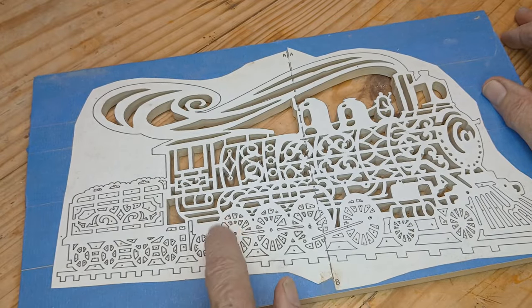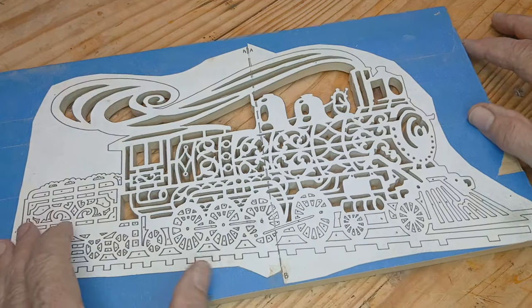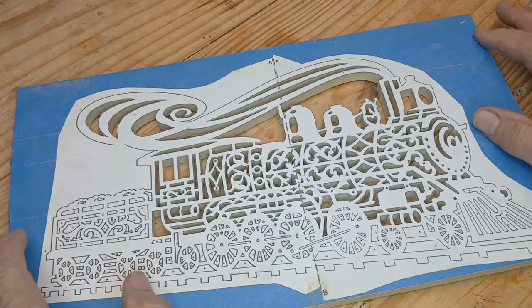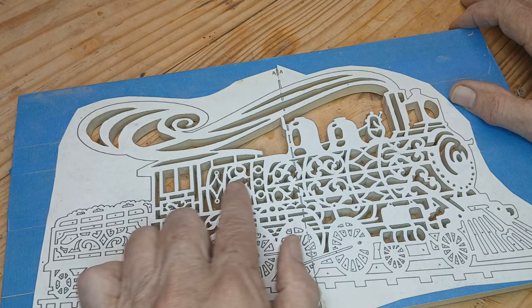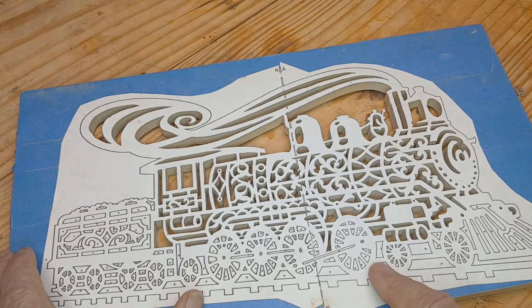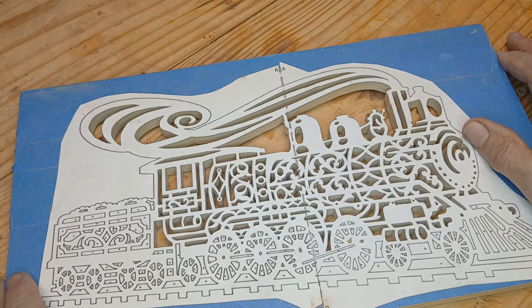In these areas I would probably use a 3 — I cut all those with 3. Some of the really tiny ones here I might prefer to go to a 1. Now pieces like this, these cuts I could do with a 5. That's my choice, but not necessarily the right choice. Somebody else might say different — it's a matter of personal experience and what their particular scroll saw can do. But for me, with the setup I have, I would cut these with a 1 or a 3. I'd probably use a 3 in here, but down in here I'm probably going to go to a 1. You could cut even the larger sections on this piece of wood with a 1, because it's soft enough and not super thick.